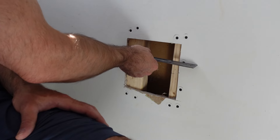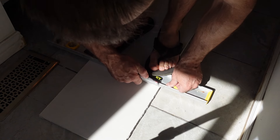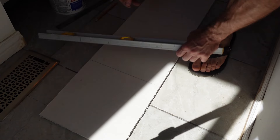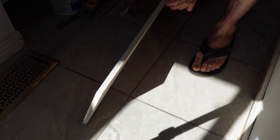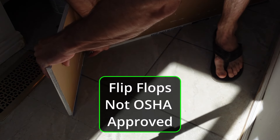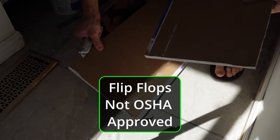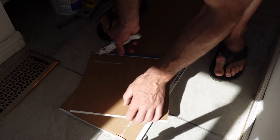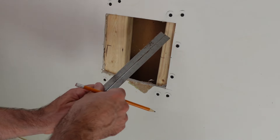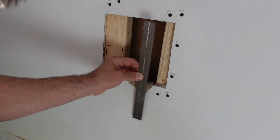I don't need the patch to be 12 by 12 like those boards — I'm going to go with a 10 by 10 patch even though the hole is only 7 by 7. I had drywall in the basement so I grabbed a scrap piece about 10 inches wide and I'm going to make it a perfect square. I'll score it on one side, snap the drywall, then cut the paper on the back side. This gives me an inch and a half on either side of the hole — this is what they call a California patch.